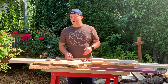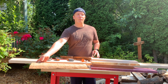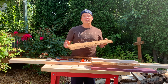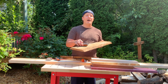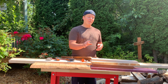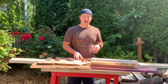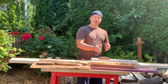Another great application is when you're finding wood on Craigslist or Facebook Marketplace. Like this piece — some claro walnut — I didn't know if it was fully dry or kiln dried. The only way to be sure is to test it and check the moisture content to see if it's ready for furniture. Some people even test hardwoods from their lumber yard, though I personally trust mine. It doesn't take much to gauge it against other readings.